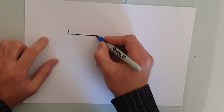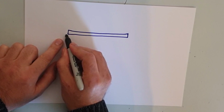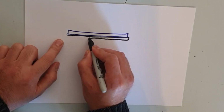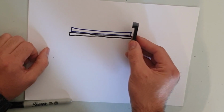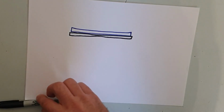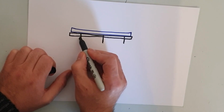So essentially, you've got your primary mirror like this, and what I'm planning on doing is having it placed on a plastic plate made out of HDPE or something like that. I'll have to look it up later on, but it's a type of hard plastic. And I'm going to have these holding the mirror in place in three positions on either side, on this plate. At the bottom of the plate, you're going to have three bolts going through on either corner, with a heavy duty spring.